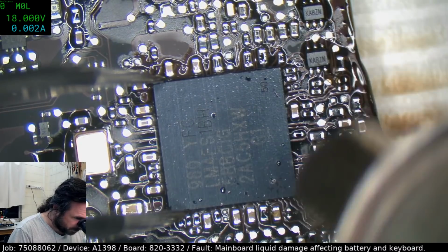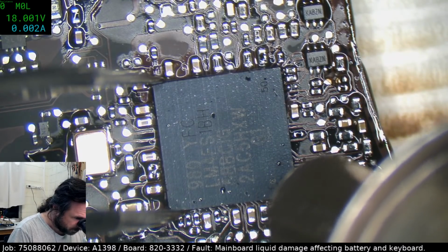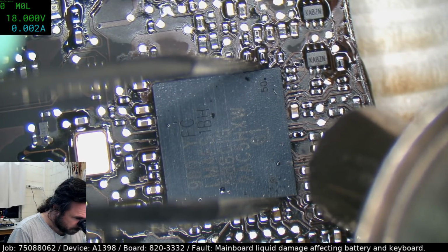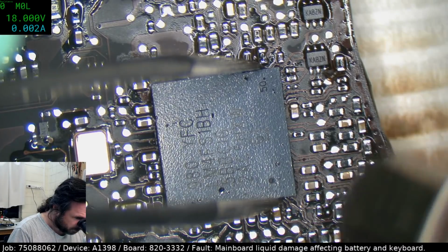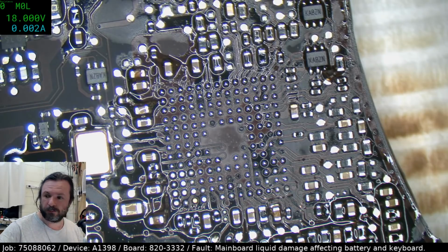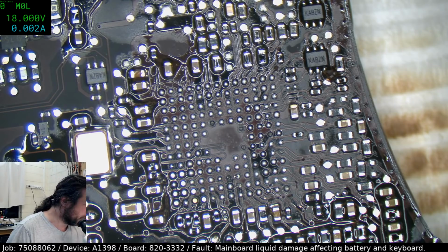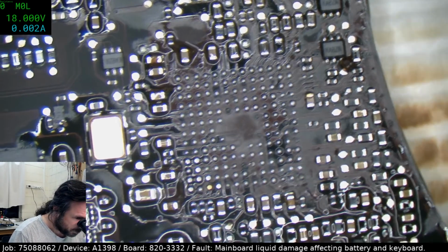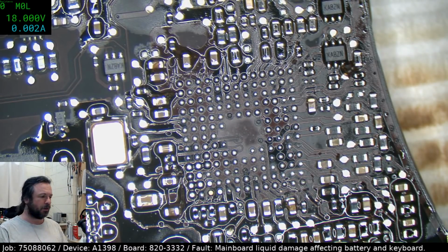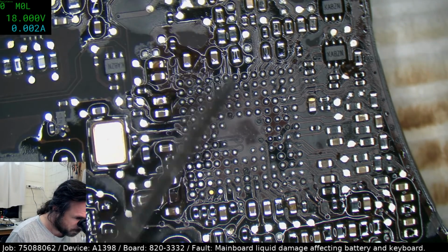Okay, I'm a little worried here that this is going to be another one of those ones that I've got to twist and pop. Thank goodness for that. Unfortunately, no, it's not really much good for the iPhone underfill. Pretty much strictly only the overfill. I mean, you can pick at it, but for the underfill you do really want those things like this. Yeah, these sort of type blades.